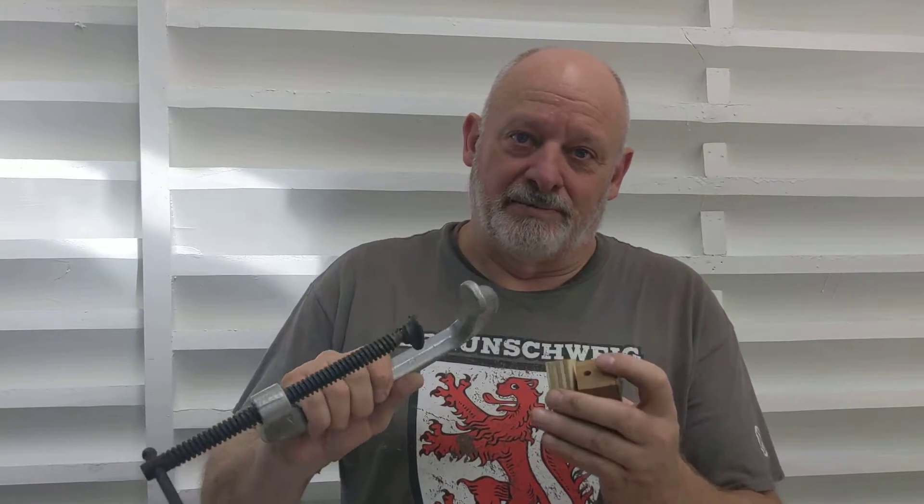What I'm going to do is use these little blocks of wood and a C-clamp. I'm going to clamp onto the blade with these blocks of wood — one on each side of the blade — to hold it without damaging the blade. Then I'm going to use this adjustable wrench to go down in there and loosen the nut on the arbor. Normally table saws come with a thin metal specialty wrench set that holds the arbor and one that fits the nut, but I don't have all those tools, so I'll show you how we're going to get around that.